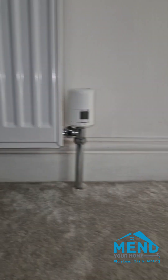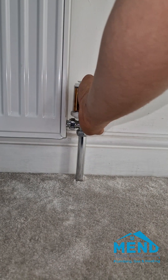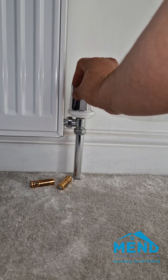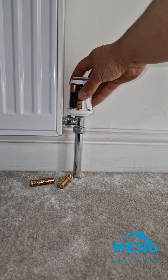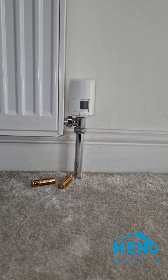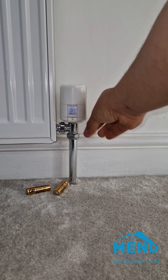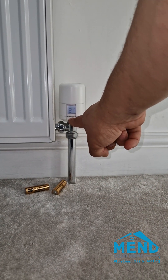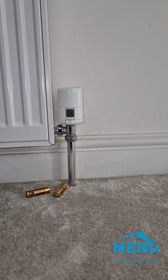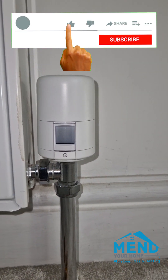That's the next radiator with a Hive TRV on it. I'm going to do the same thing — click the tab in and pull up, remove the batteries, put in new batteries, then twist that round clockwise and put the cover back on. In some cases the M symbol will already be showing, but in this case it's just showing temperature, so we hold the button down — that puts it into search mode. There's the M symbol showing again, now we can search for this on the phone.